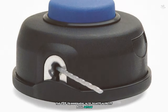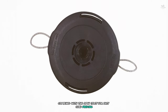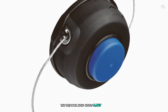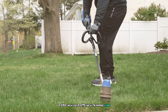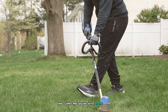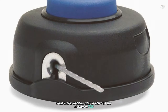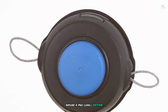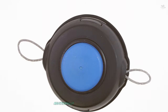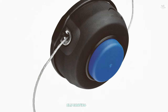The T25 trimmer head also boasts a split spool design which reduces tangling and line welding. This design, combined with the open eyelet for easy cord feeding, ensures a seamless restringing process. The trimmer head holds 0.065 inch, 0.080 inch, or 0.095 inch trimmer line and comes pre-wound with 0.095 inch titanium trimmer line. Durability is another strong point — optimized material combinations ensure a prolonged lifetime, making it a cost-effective choice in the long run.